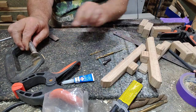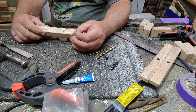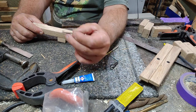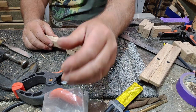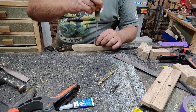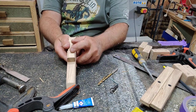That's one done using a clamp. Now I'll do pretty much the same thing again with the vise. You could use posidrive-type screws, like this 3.5mm one, but I'm going to use these bugle-headed plasterboard screws. They're quite good for this job because they have very sharp threads and a very sharp point, so they tend to cut their way through quite nicely with the least amount of force on the piece of wood. That's my vise — an old Record vise, very old. Put the wood in there like so, and the vise is now preventing that little block of wood from going sideways and splitting.